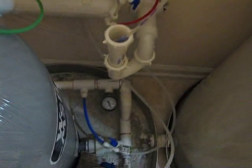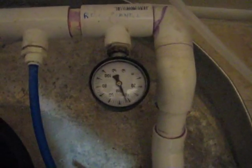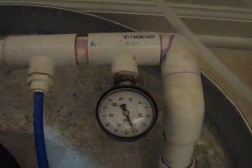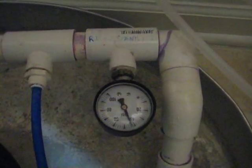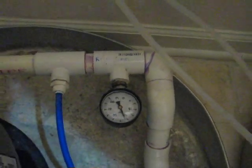The other gauge is the house gauge. By using the permeate pump, I'm actually able to generate some pretty high pressures on the supply side — that's over 40 PSI right now on the house side, which really increases the delivery.